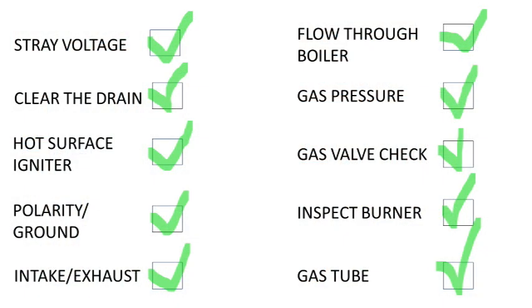After completing this list of items and the boiler still will not light, we come down to two components to replace. At this point, we either have some type of internal control fault in the module that is not showing itself through the normal diagnostic process, or we have an intermittent gas valve — both are basically beyond real-time diagnostics. We recommend trying a new gas valve first. If the problem is still not resolved, replace the control module. If neither of these devices rectify the problem, some part of the diagnostic procedure was skipped or not completed correctly — go back through the steps and make sure each one is performed properly.